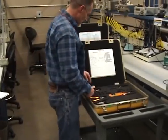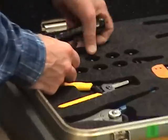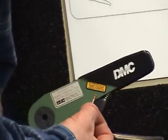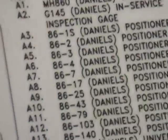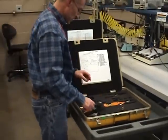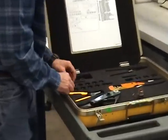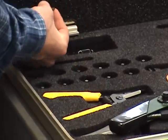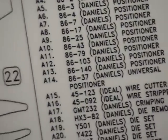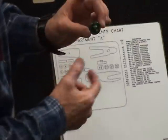My tool handle and positioner — it said I needed this tool handle. Looking in position number one, I verify MH860, just like it said on the chart. I can see MH860 — my crimping tool. Then it also said I need positioner 86-2. Looking in the four spot, I verify 86-2 and confirm they didn't get out of place. 86-2 on the positioner — that is my guy.